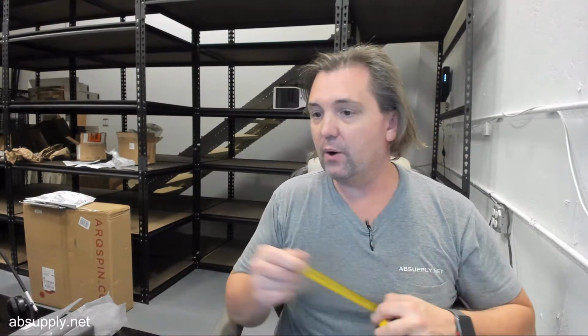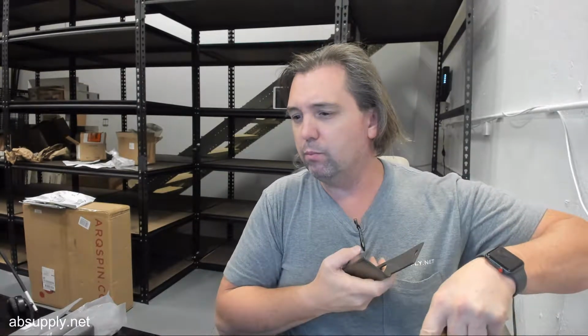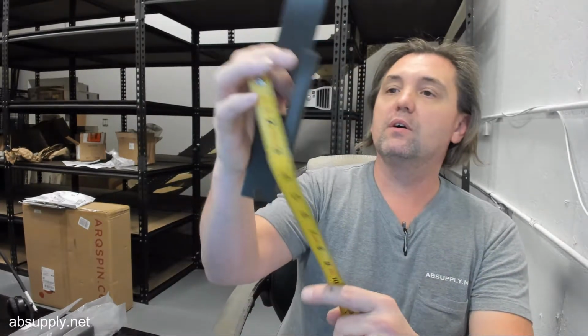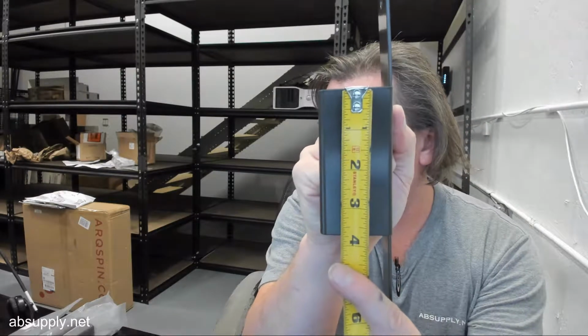Now, below this video is a link to a document called Template, and let's go over all of those dimensional properties of this now. I like to verify. 9-inch overall height, that appears to be accurate. Width of the plate would be 1.1, 7/16 roughly, a little shy on that. Actually, forgive me, closer to 1 3/8. That's accurate. You have an overall height of the face filler, the face of the frame itself, at about 3 3/4, and that is correct.